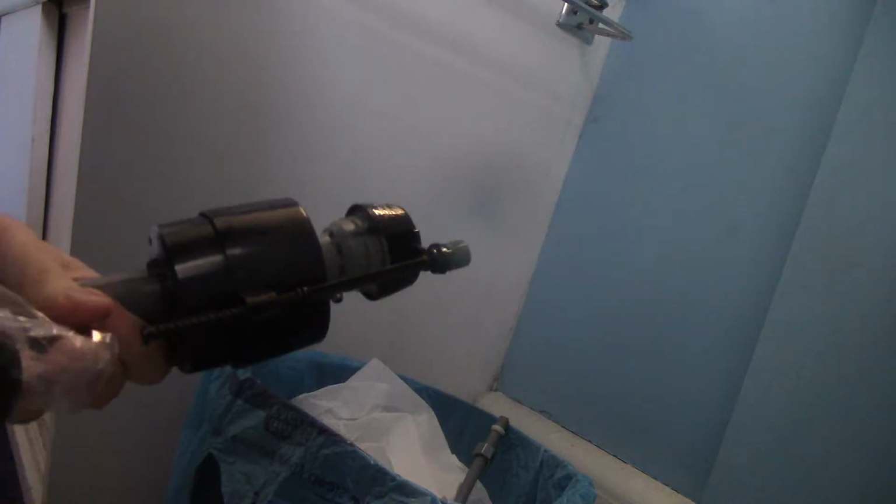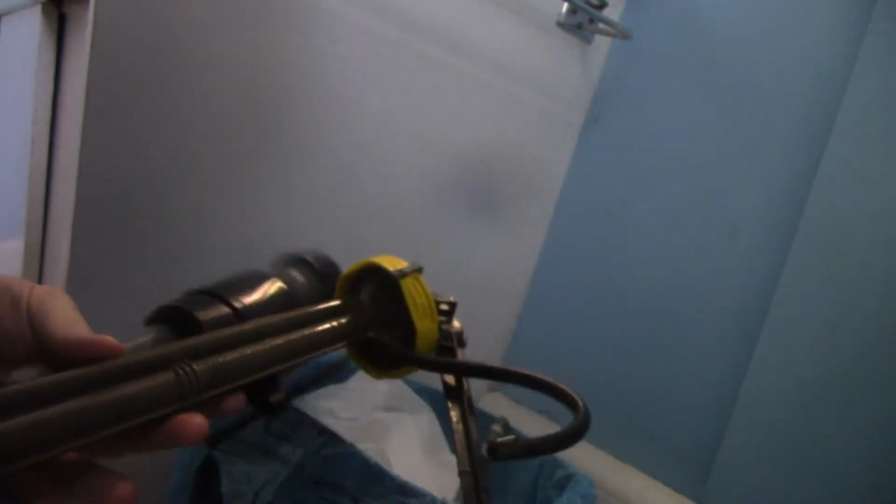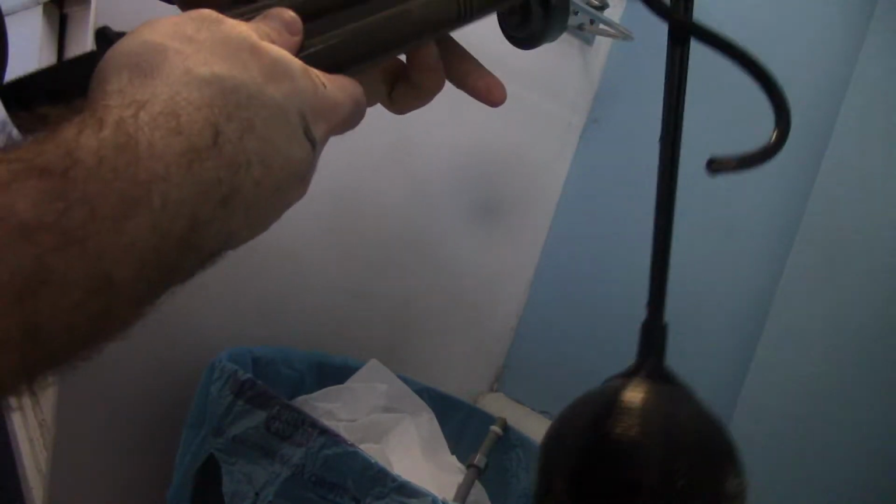Okay, see, toilet. Pull the valve out. It's got 2 hoses. It comes with the second hose. Let me put this down so you can see what I'm doing. It's crooked. Sorry about that. So I got my new valve. Comes out. It does have instructions with it. And a hose. There's the second hose. So how this goes, you got your new valve, you got your old valve, which is right here, and you're supposed to put them side by side. And the new one kind of ratchets out. So what you're trying to do is to get a rough height.